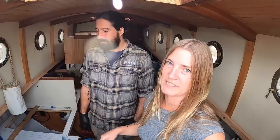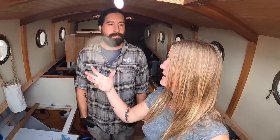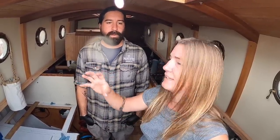Because it's so much of a leak, like it was almost a steady stream, we're going to take off the whole housing of the oil filter. That whole attachment has like two plates, and then we're going to reseal all of that and then test the motor again. Probably try to retorque all the oil pan bolts.